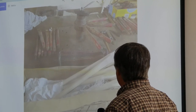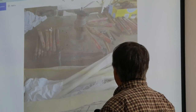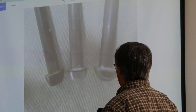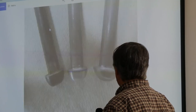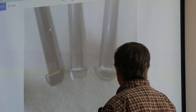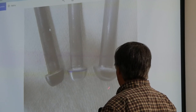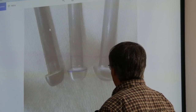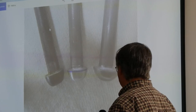There's the box of spokes as they came to me. I had to do some modification to the rivets. This is an original rivet. The rivets as you buy them nowadays — the heads on them don't match. So I altered the heads, made them the same diameter, and filed them to resemble the original rivets.